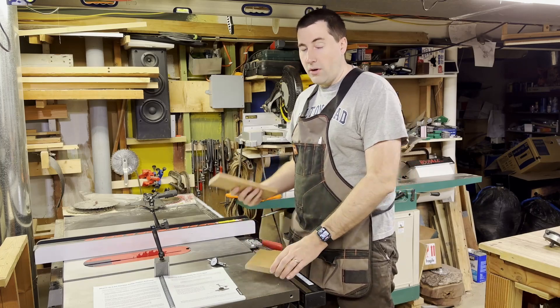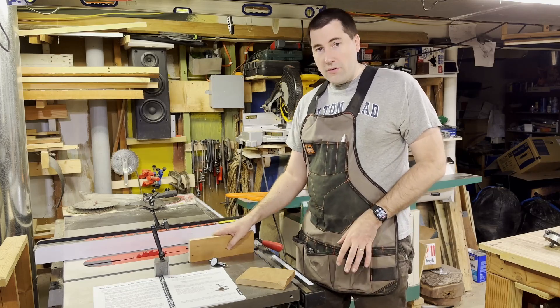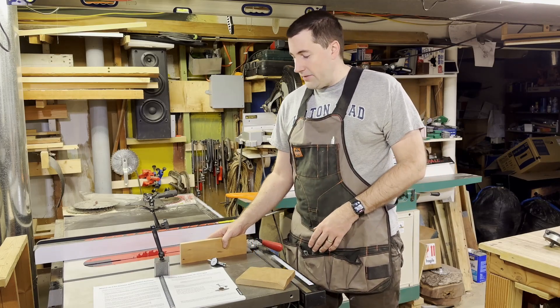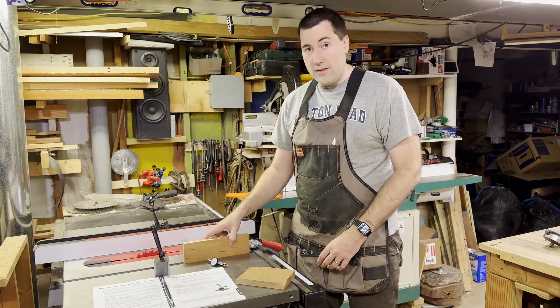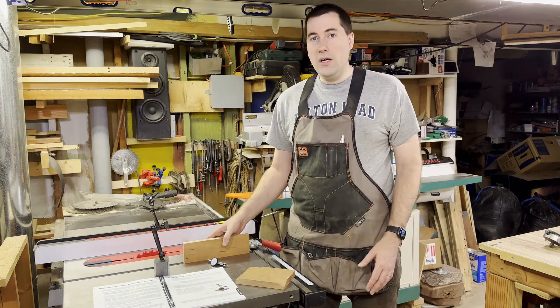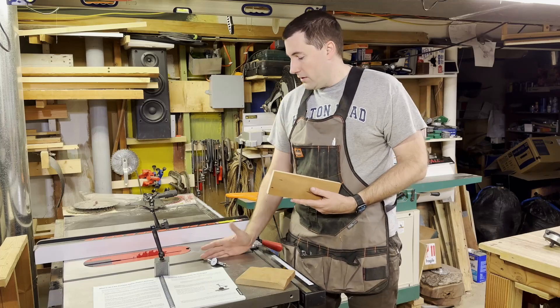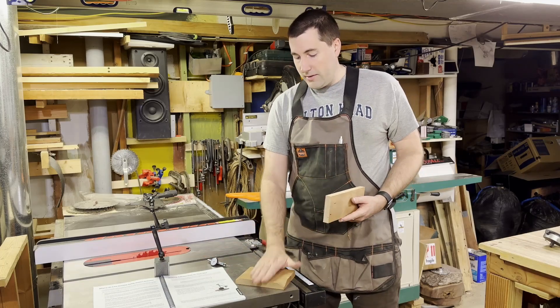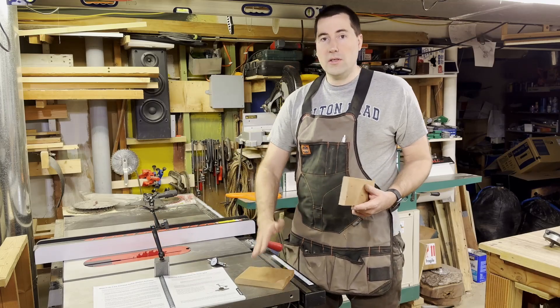When I was first looking at this, I thought it was very important that the fit in the miter slot be really tight. This is a pretty good fit — you definitely want a pretty good fit, but it doesn't have to be perfect. When you're moving it back and forth, as long as you're holding it in the same manner, you'll get consistent readings and that should be good enough. So the first thing we're going to do is use the table saw to cut a thin piece that'll fit nicely in the slot, mount that on the bottom of the board, and then mount the indicator on top.